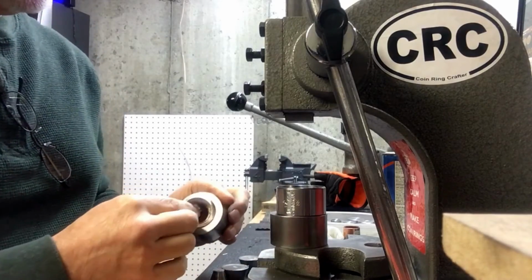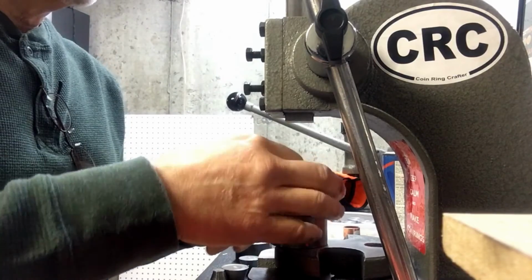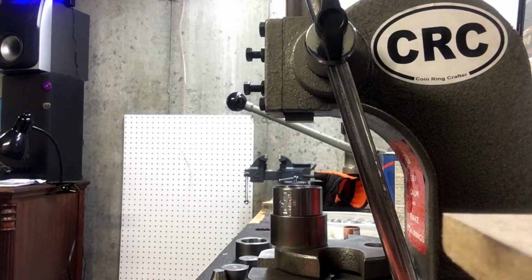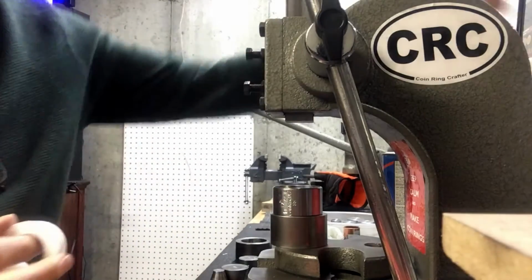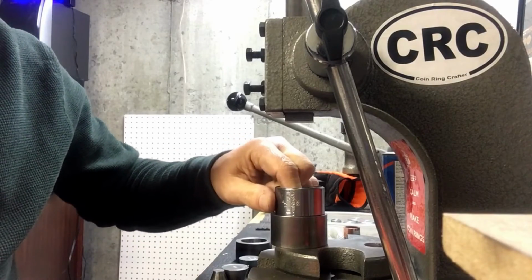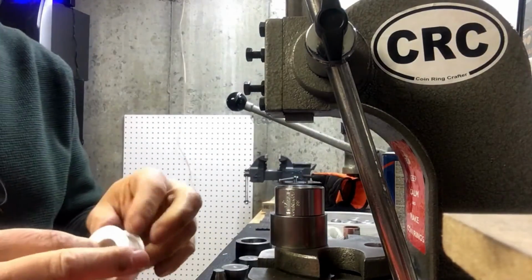All right, what I will do here, before I open it up on the ring stretcher, I'll actually use this die as an extrusion die, because the more I press with that cone in the center, I'm going to end up risking losing some detail. So I'm going to wrap this up 10 times, put it in this die, use one of my aluminum pushers and just push it down. Start the extrusion process a little bit sooner.